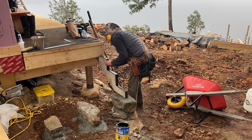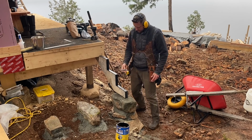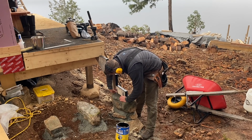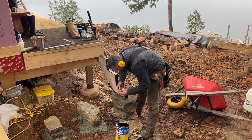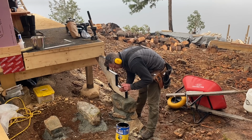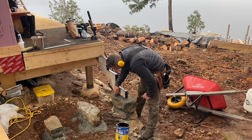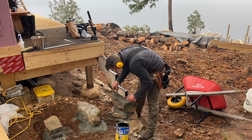Now what I usually do is I've got these 3.5 inch by 1/2 inch galvanized legs. I usually screw a leg into the bottom, and then the stringer sits on the head of the leg, and you can adjust the legs for height just by putting a wrench underneath there, screwing them in and out. You can lift and lower and level your stairs. So if it's on an uneven surface like a rock, you're going to need to be able to adjust the back leg to be a little higher or lower, right, for the uneven surface of the rock.